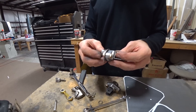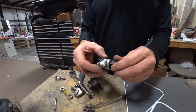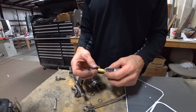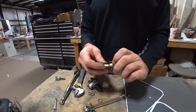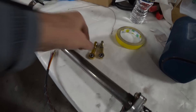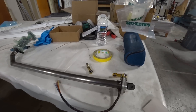I got those together now, so the job is to put them back onto the side sticks. I also need to adjust the length on those rod ends — that gold one sitting on the table is a little bit too long. I need to make it as short as I can to give the most amount of throw. I cut those a little bit, got them connected together again, and put a locking nut on there, so that's all sorted out and ready to go in the aircraft.